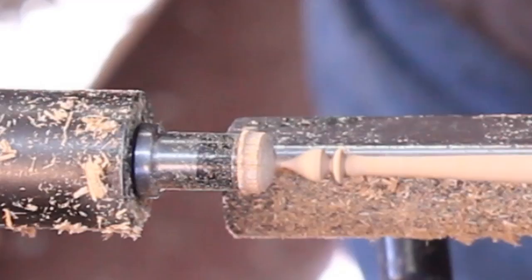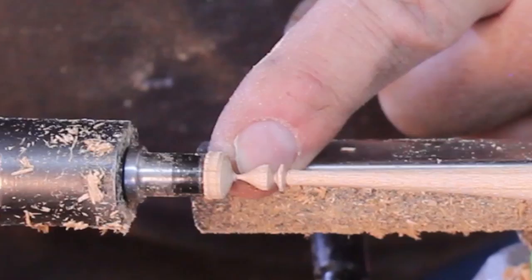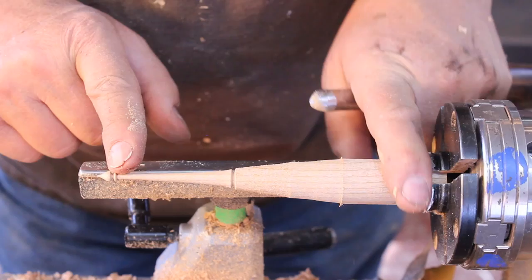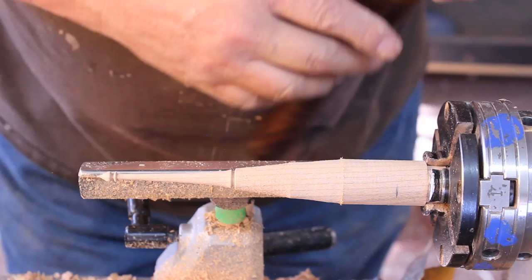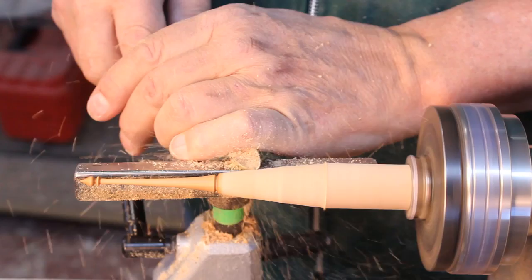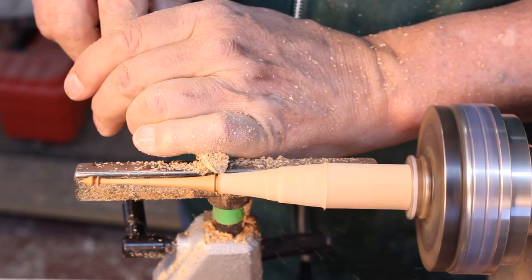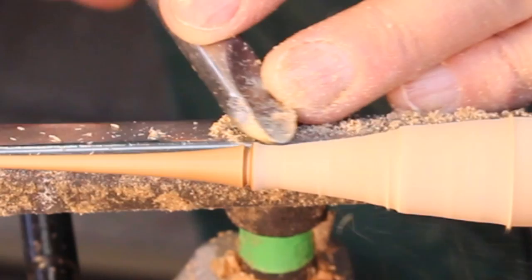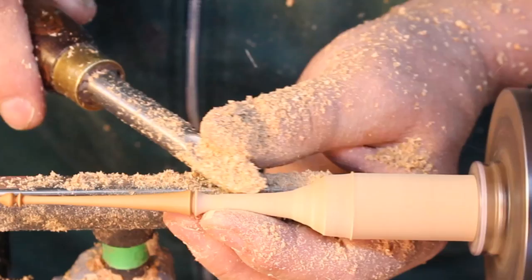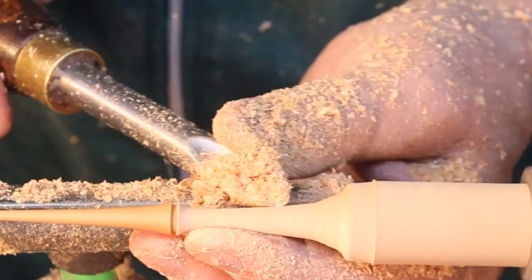You probably noticed that this broke off as I developed that little point. So I'm going to back off my tail stock because I can't use it anymore. I'll do a little bit of sanding and some profiling with sandpaper. Back here I've got a little bit of mass and I can keep working back to my headstock. Now I've got my finial finished, sanded, and a little bit of friction polish up to this point, so I'm going to continue back to the headstock. With my detail gouge I'm just removing a little bit of this mass closer to my headstock — working from the very tip of the finial backward, where there's more thickness in the wood for stability.